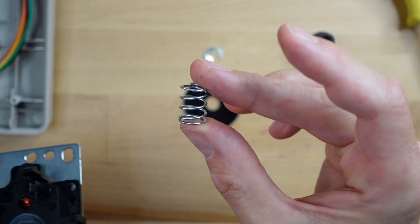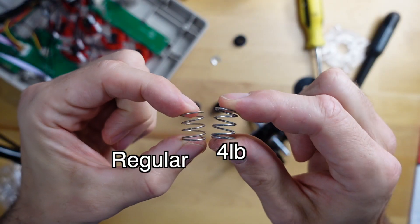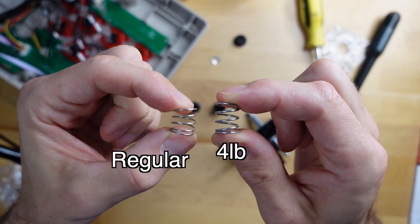The E-clip is also very easy to bend and break if you're taking it off the wrong way. So next time you're making an order from the arcade parts store, throw in a couple of extra E-clips. They're like 20 cents each, but if you break one, you are going to thank yourself you have some spares. A standard Sanwa JLF stick has a 0.9 pound spring, but it's pretty common to find 2 pound and 4 pound aftermarket springs. I say buy them both — they're only a few bucks each. Try them out, see how you feel. Remember that as you change and evolve or play different games, you can swap it out. You don't always need to have the same configuration.